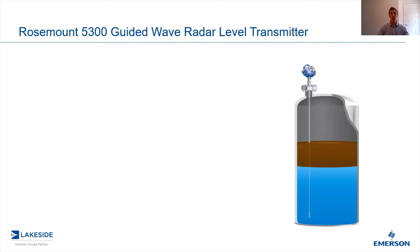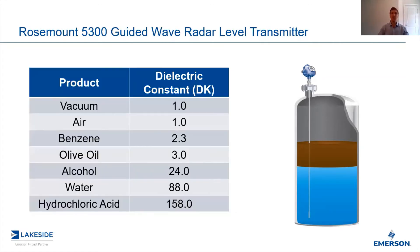So how is this possible? Well, we have to go back to the basics and look at the dielectric constants of various products and understand that the greater the dielectric constant, the greater the strength of the signal return. In most oil-water applications, the oil is on top and the water is on the bottom — that's the difference of their specific gravities. Now what happens is the microwave pulse is not entirely reflected by the oil. In fact, a good portion of the microwave pulse can travel through the oil and reflect off the next layer below — the water layer. And beyond that, actually some of the microwave pulse can continue and reflect off the bottom of the vessel.